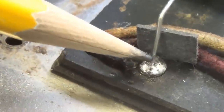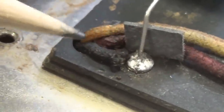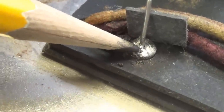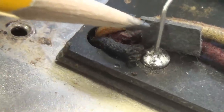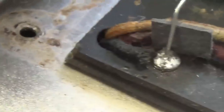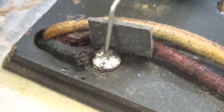Then, to prevent the reoccurrence of this short circuit situation, I closed the gap in the insulation of the red wire, pushed it back as far as I could away from the eyelet here that's grounded, and then I put an L-shaped piece of rubber impregnated insulating board between that wire and the grounded eyelet. So I think we're safe and secure here that grounding situation will not reoccur.